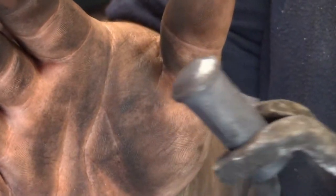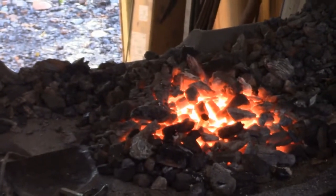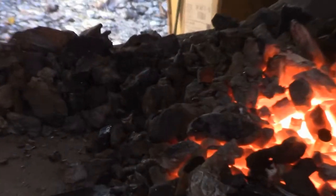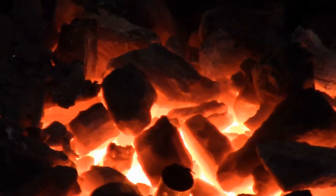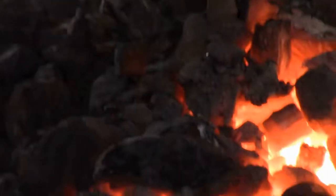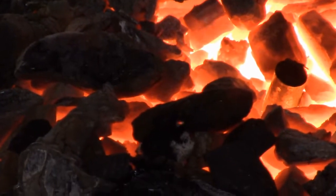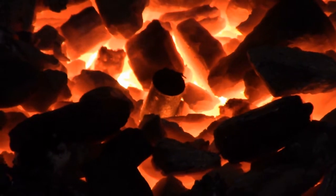Oh, also, it's another thing that I found out. If I take them big old tongs I got there for punches, and I hold that thing pretty darn far down, like hold it where it's still red hot, I can slow down the bending when you're trying to upset and you get that darn bend. I can almost control it a little better.